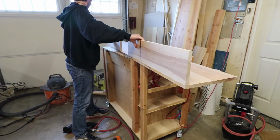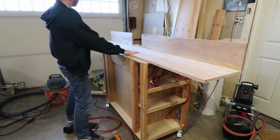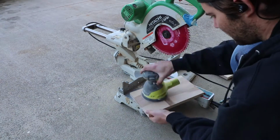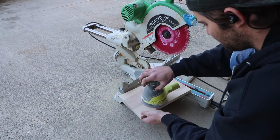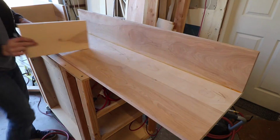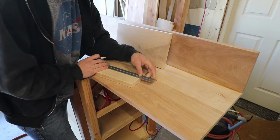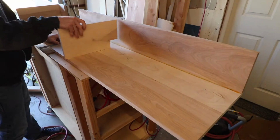This thing is a monster of a mantle. Next, I need to work on the dividers. This thing will be divided into 3 parts, with the dividers really helping to strengthen the structure. I needed to create some sort of cutout in the dividers to allow cables and whatnot to cross. So I cut out 2" by 2" squares in the back. This would be plenty of room for all the cables to run from one section to another.